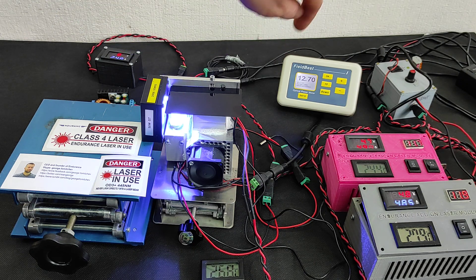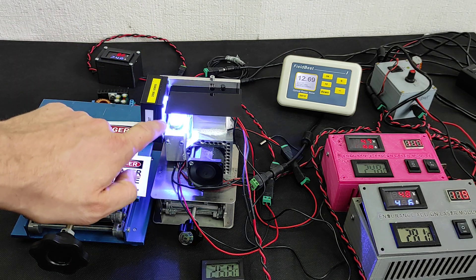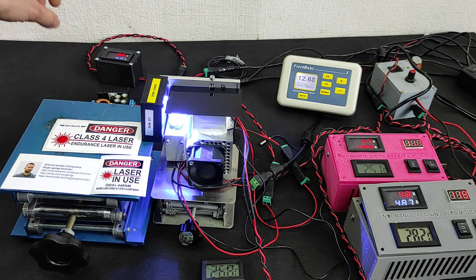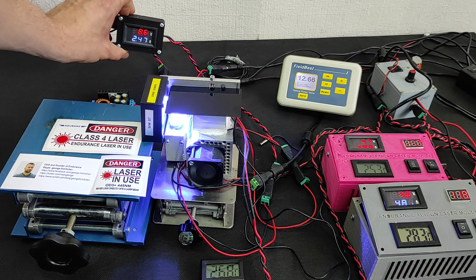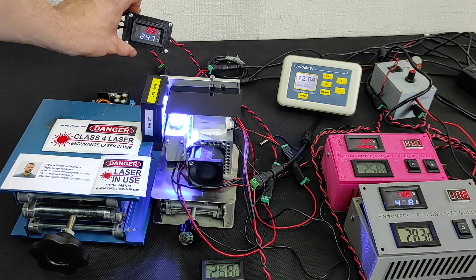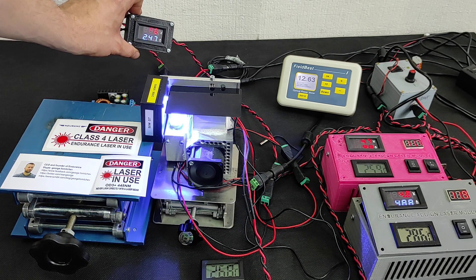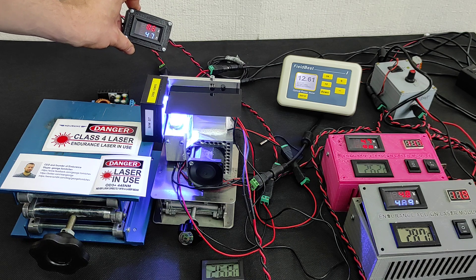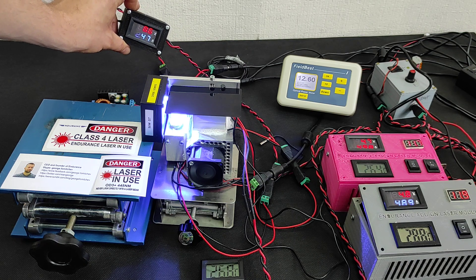You see that's 12.7 watts, and we have some losses on the prism — don't forget about that. We also had some losses on the G2 lenses. Here we have measurements for TEC cooling: it's about 8.8 volts at 2.5 amps, which means it will remove something like 20 to 22 watts of heat.